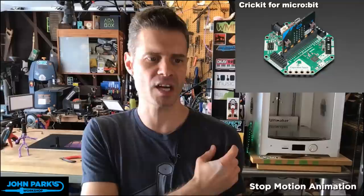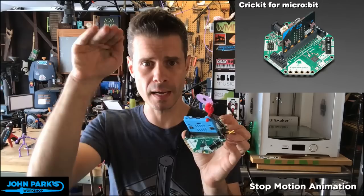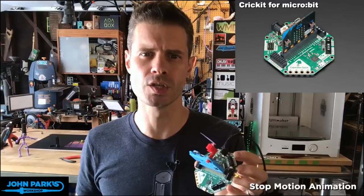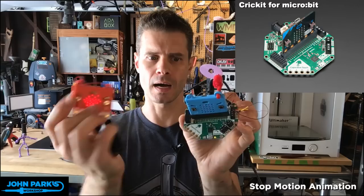Part two of it is you'll need the URL for adding the extension or the package for the Crickit, which is in a Learn Guide that I think maybe Mike Barela wrote. So if you look up just the main Crickit Learn Guide, you will find the MakeCode instructions for that. I think that will become easier soon as it comes out of beta. That just becomes an easier to add extension. But yeah, just a Bluetooth connection between these two, and when this sends the A button, this will spin the motor. When it sends the B button, it'll stop.